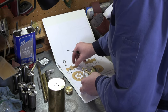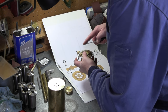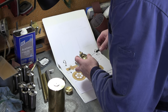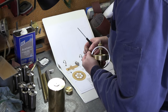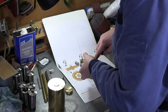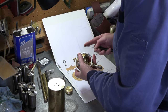All right, right now I've got 1/4 inch set screws. 3/16 would be better, but I didn't have any of those at the hardware store, so I've got some of those coming, but for right now we're gonna use 1/4 inch. Yep, you can feel that lock in that groove we've got there. So that's just what we're looking for. May put some Loctite on these after, we'll see. This is just a good test check here, see how we're doing.